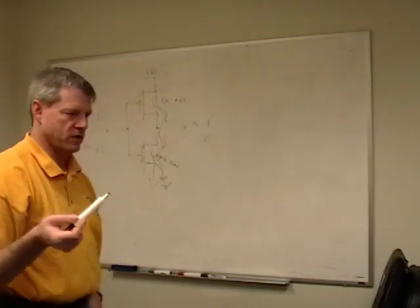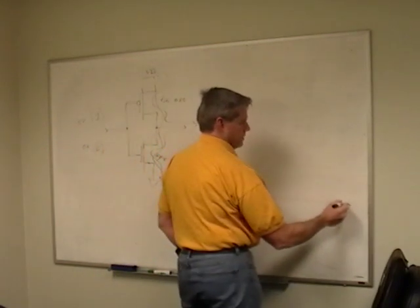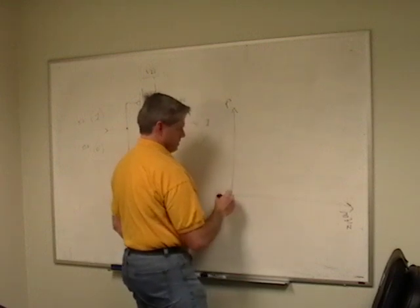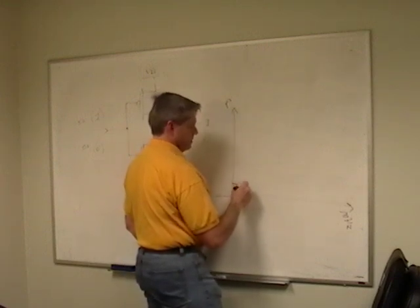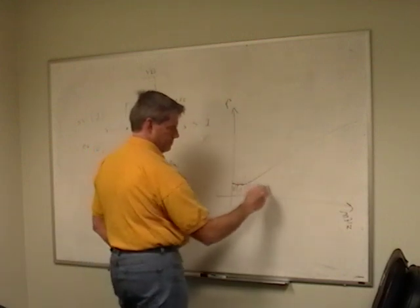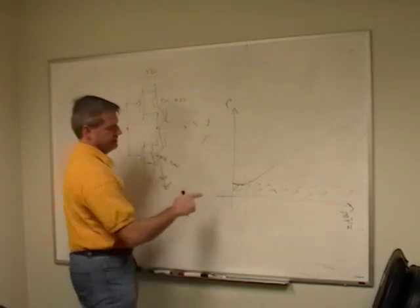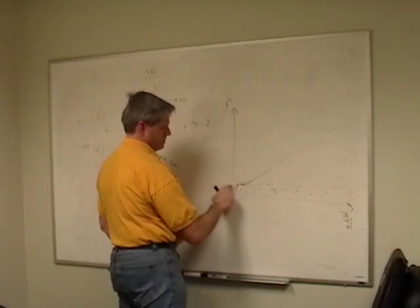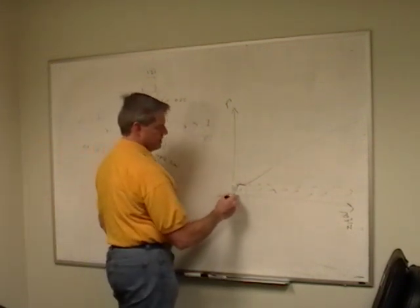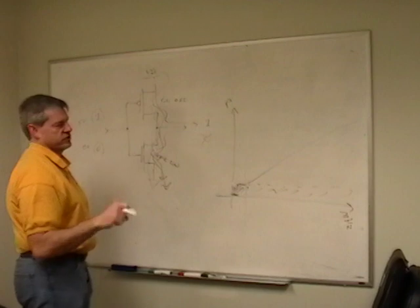And this is one of the reasons why, if you look at a digital device's power curve, they'll usually have something that looks like this: power versus megahertz. It basically starts off here and goes up like that. And so this baseline power is what you lose going through these things. I mean, actually, it comes up like that. Because if you're not switching at all, you lose basically none, just the leakage of the transistors. So there's some leakage level, and then there's this switching power that you're never going to get below as long as you're switching.